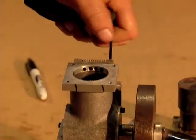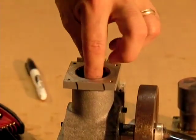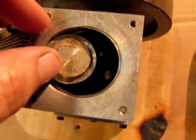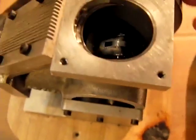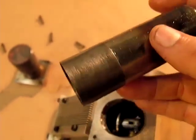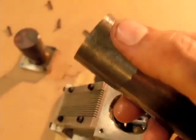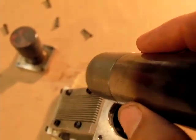Alright, so I've got these tightened back down. I'm going to take the camera off the tripod and show you the inside of this engine. The part that actually holds the displacer — you can see the glue that I was talking about. It's on a swivel in there. Here is the displacer, and you're going to notice that it is a little bit smooth here and a little bit rougher here. There is about a 32nd of an inch difference in width — this is bigger than this — so this fits in there.